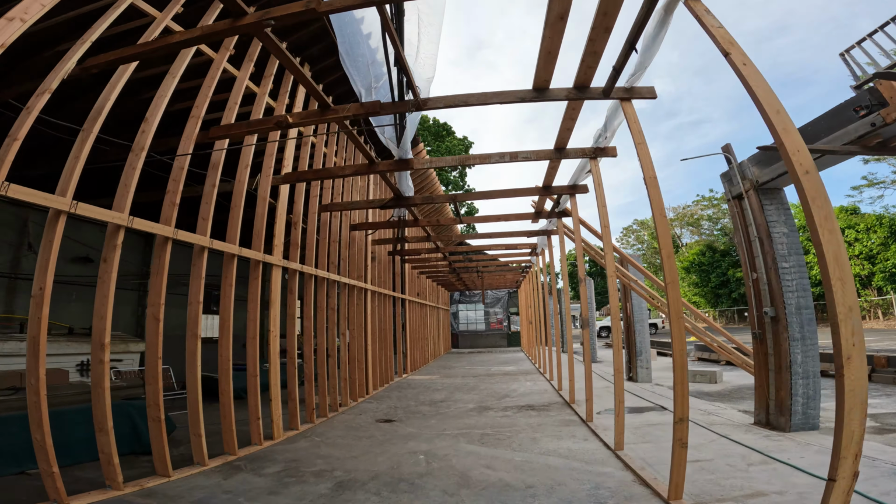So yesterday I forgot what these boards were for. These are 12-foot 2x8s. That's for the beam packing. Once that W beam goes up, we're putting one of these on the top to where the rafters are gonna land, and one on the bottom as a nailer for our fascia boards. Basically, it's the finish we're giving this on the outside. It's just gonna be cut up plywood and rip it on table saw into strips and box in that beam and the front of the rafters. So I ordered 12-foot 2x8s, and that's what those are for. I forgot what I got yesterday.